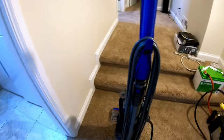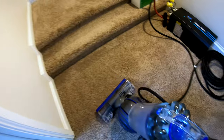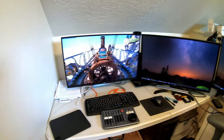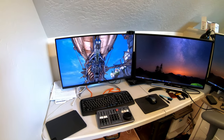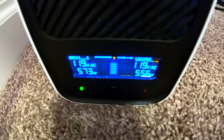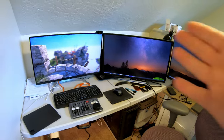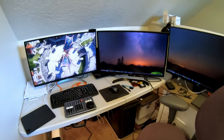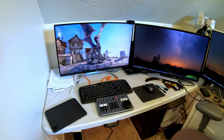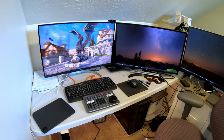Can the Seacon 12 volt 100 amp hour lithium iron phosphate battery run a full-size household vacuum cleaner? No problem at all. Can it run a high-end desktop gaming PC workstation? We've got three 4K monitors running a full 4K gaming benchmark to really push the computer. Power goes through a UPS by Golden Mate which tells us consumption — we're easily pulling just under 600 watts. At that consumption, the battery would run this computer for approximately two hours if fully charged; standard tasks would significantly increase run time.